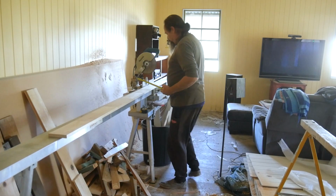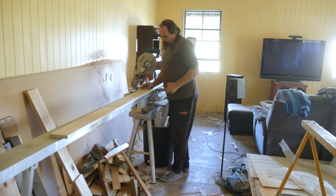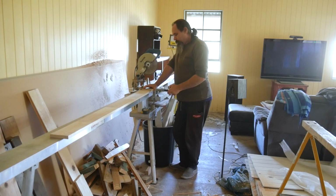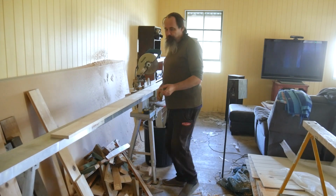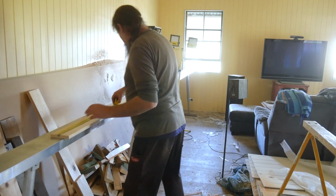The only dressed timber we could find was 115 millimeters wide. We need 100 millimeters, so we'll need to rip it down. But this is a bit tricky with a 5.4 meter length and no bench saw. So we'll need to cut each piece to length first.